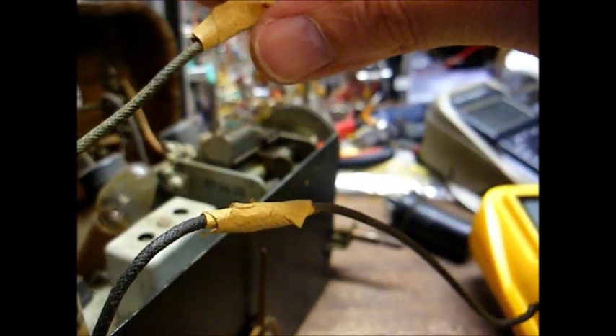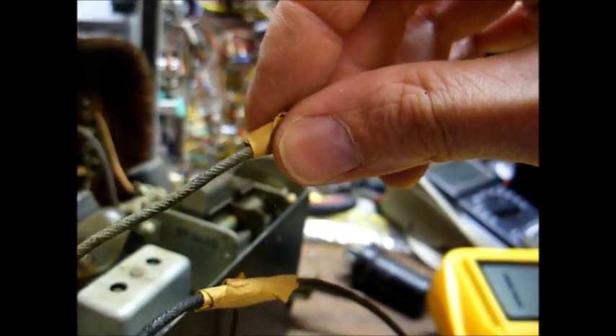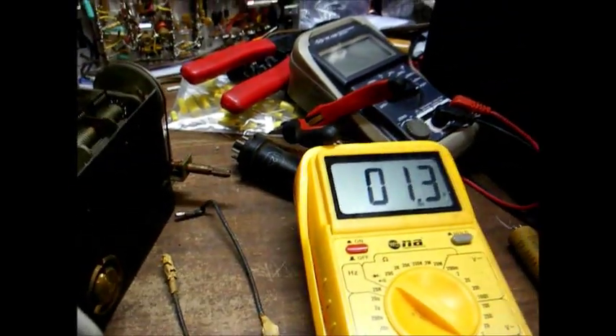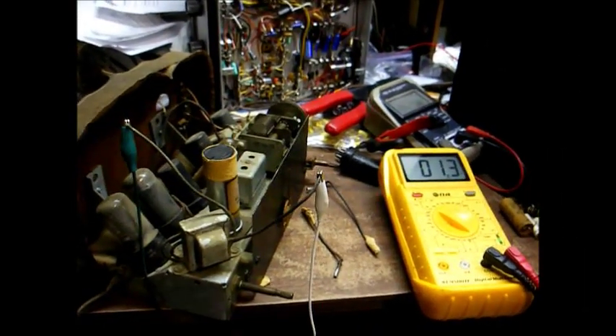Here's our audio output transformer. If we look up the leads, you can see that they've been spliced. I don't know why some service technician didn't just unplug them from the speaker like you're supposed to. In fact, this is real loose here, so it's quite possible these connections might not be secure. I'm going to remove this and check again. It appears that shoddy workmanship was the problem. I have the meter connected directly and we now have a reading. We'll just clean this up, re-solder it properly, and slip some heat shrink tubing over it. Here we are soldered back together and insulated with heat shrink tubing — getting the desired results now.